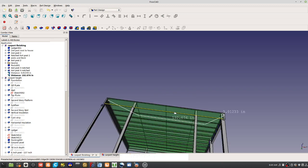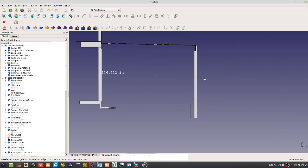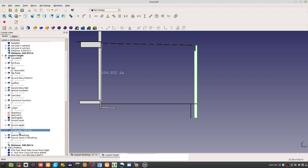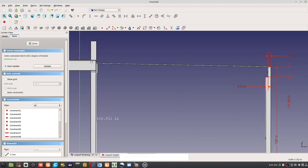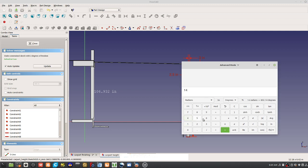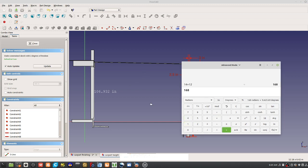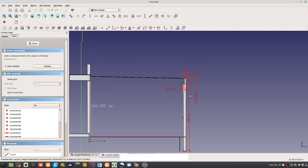Now, the cut list is you've got these posts, and you've got to cut them to length. It's already measured. The height is defined. Good. So if you look at the sketch under that, 150 inches. That's what the CAD says. So I'm going to go by the CAD since this is pretty tight here. We know we're pretty good here. All the dimensions here are right. The CAD says it's 150 inches. So let's cut this post from, I think it's 14 feet to begin with. And what's 14 feet? 14 times 12 is 168. So we're going to cut 18 inches off it. So that's 150. And then we're going to notch this.